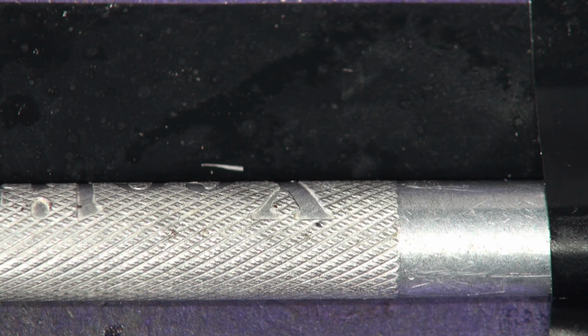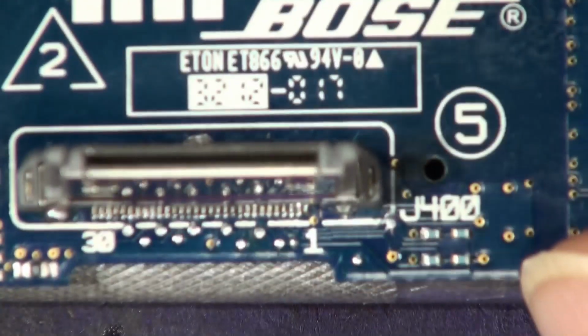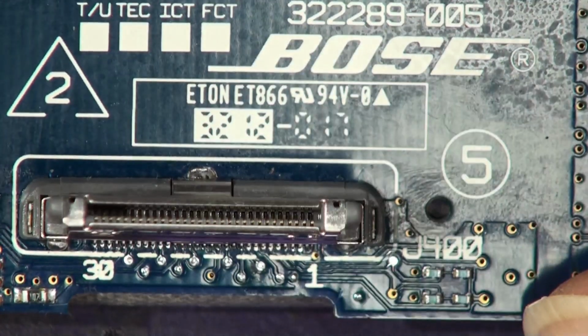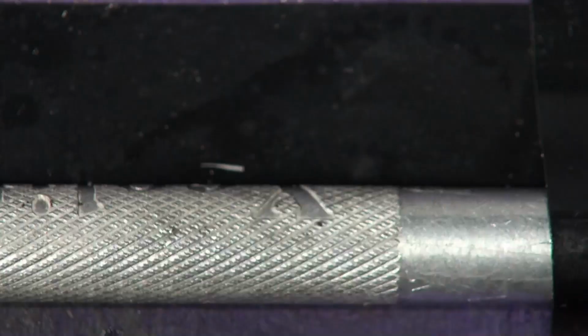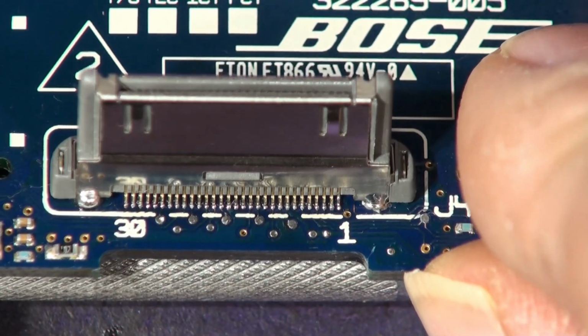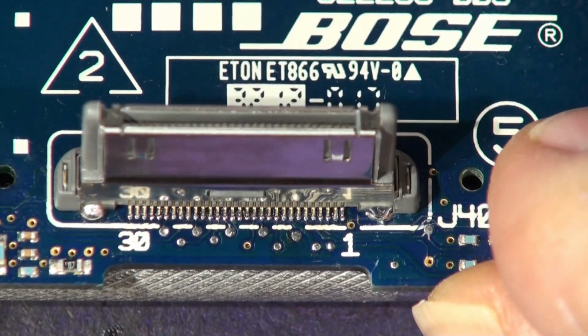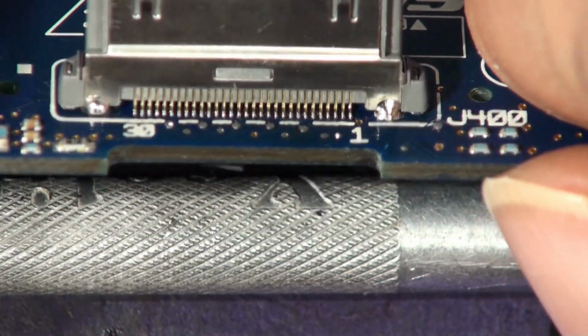So the last thing you do is clean the actual connector inside with a brand new clean brush and some isopropyl alcohol, or contact cleaner will do it. But contact cleaner tends to leave an oily residue, and you don't want that because stuff will stick to the oily residue. So there you can see a brand new connector for an iPod. Just blow out the IPA between the legs and you can see no bridges, all soldered. Alright? So that, gentlemen and ladies, is how you do that.